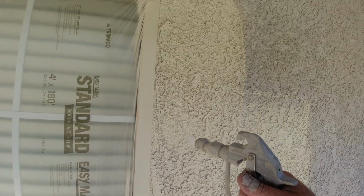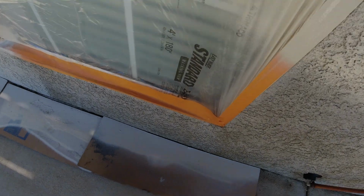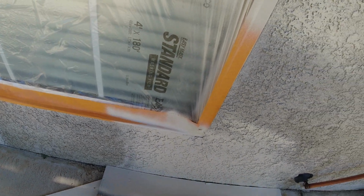You do get more overspray. They do waste more material. So you're wasting material, and all those things add up to a significant amount of money, and more time. If you've got to cover more because you're using a reversa tip, you're spending more money on materials and more time covering things. You guys, I don't know why people fight me on this. Use a flat tip setup, and just stick with it. You just have to learn it and stay with it.